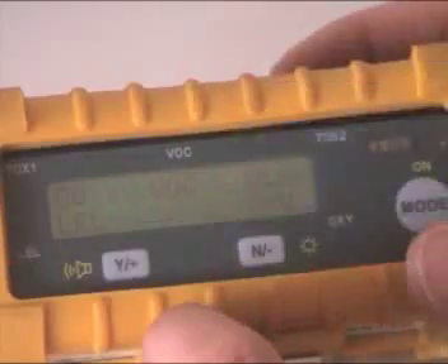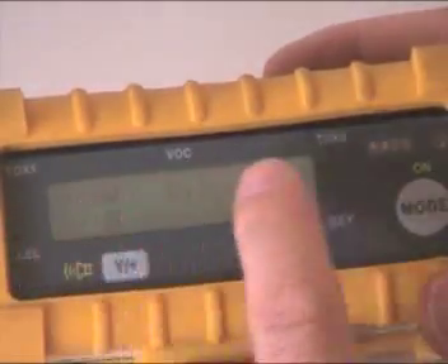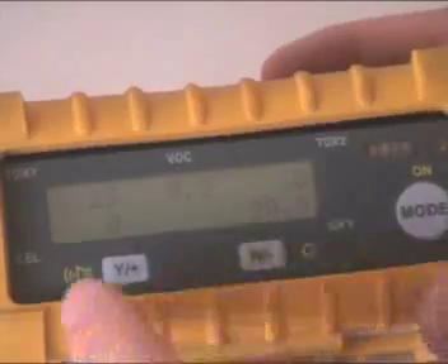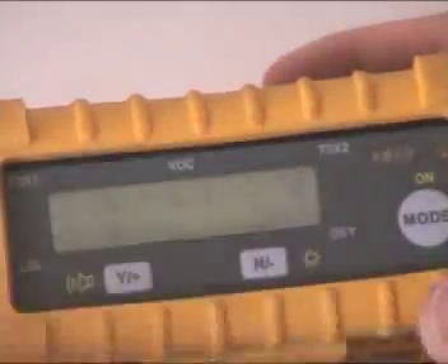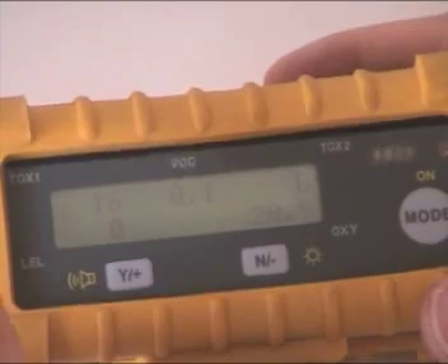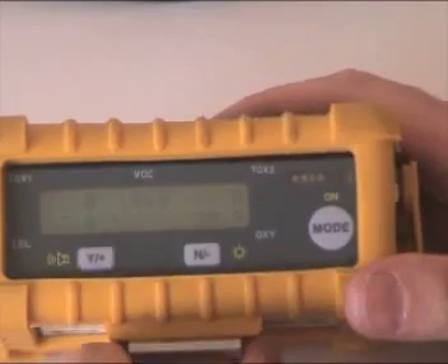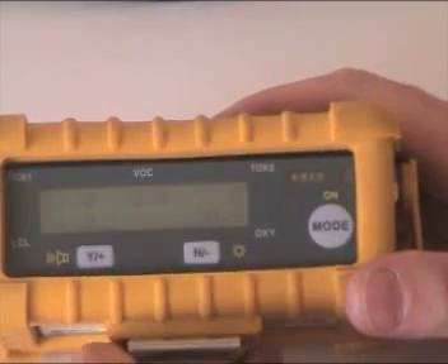Datalog resume — we're back in business. The sensors still have to clear; there's a little bit of CO still inside and a little bit of VOC, but those will clear within the next 30 seconds or so. The unit is now ready to go. It's been exposed to known values of calibration gas, you know all the sensors are working, and the unit is going to be accurate when used in your work situation. The unit is calibrated, and all that took about six minutes overall.